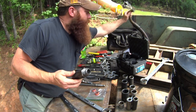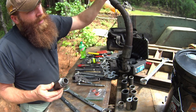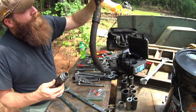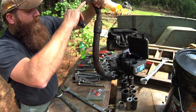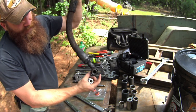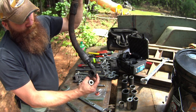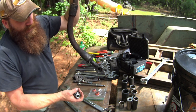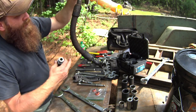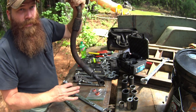These fittings are about $120 a piece from Bobcat. They've got an o-ring flange up on the top and a 16 JIC fitting down below. The problem is that they're extremely rigid. This one came off a burnt machine, so I'm not going to try to reuse it.